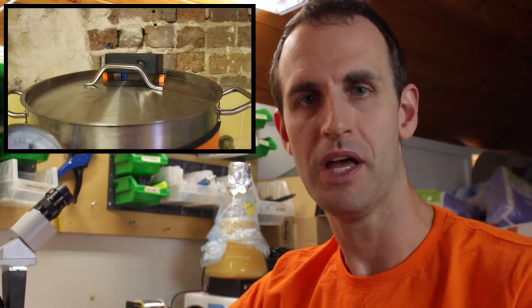Stirring — that's what I'll be doing on my next brew day, because today I'm building a stirrer for my hot liquor tank. Two weeks ago I put together a video showing different temperatures inside the hot liquor tank of my 3V Herms setup. The trouble was at the top of the water it was really hot and down near the bottom where my sparge water comes out it was getting really cold — about 20 degrees Celsius difference. So I thought I need to stir this up and get more homogenous temperature distribution throughout my hot liquor tank, and I set about ordering parts to build my own hot liquor tank stirrer.